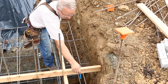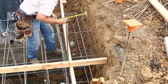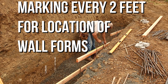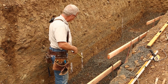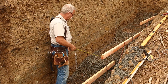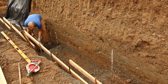The outside corner of this wall system is going to be right here. From the face of the wall we're going to come 16 inches to the edge of the first panel — that's a 6-inch filler and a 10-inch wall. From there we switch over to two-foot panels. The end of the third two-foot panel is right here, and that's where the bulkhead has to occur. Looking at the white marks I put on here when estimating where the steps should be, I should have moved the step back another 8 or 10 inches. So we're going to do a little pick and shovel work to get rid of some of the nose on these steps so there's lots of concrete in the throat of the step for structural integrity as it transitions from the upper 12-inch rise to the lower 12-inch footing.